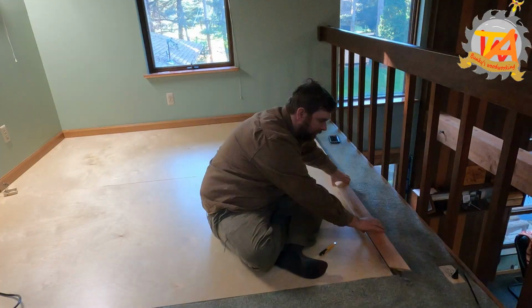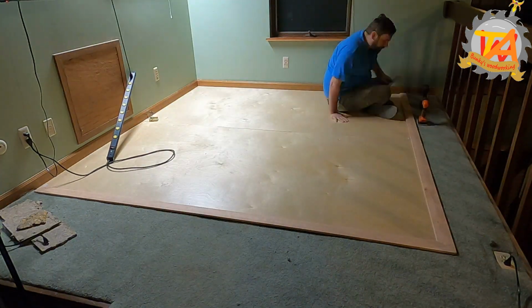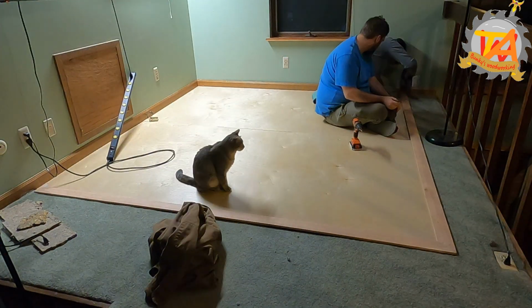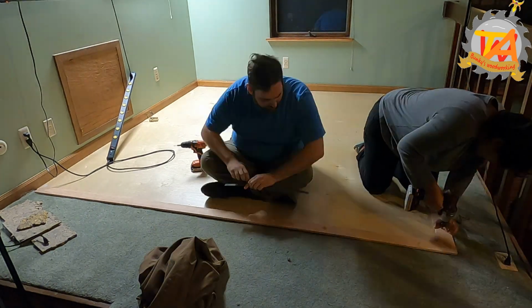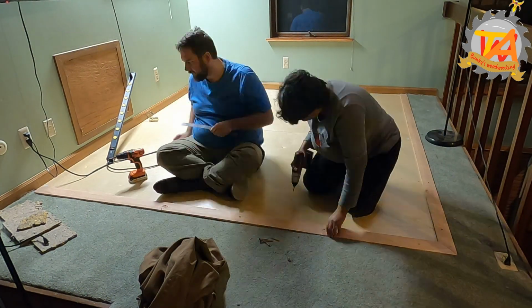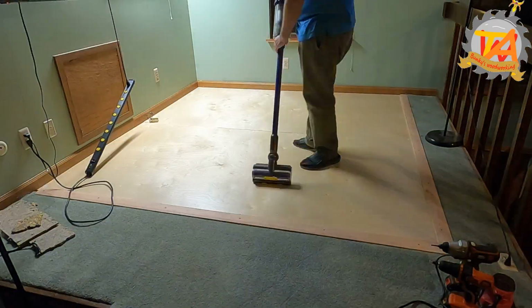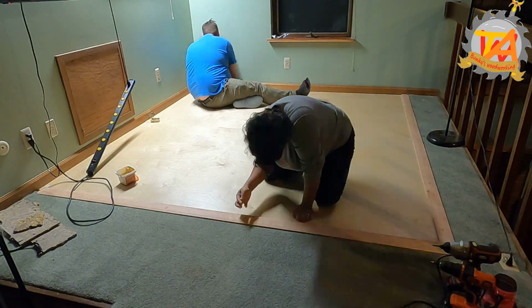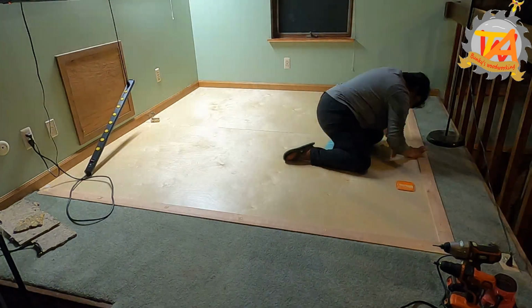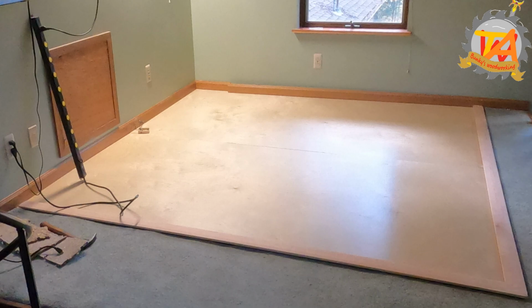Now we put the strips upstairs in order to do a dry fit. To fix the trim to the flooring, we made sort of an assembly line. Tim drilled the holes about 2 feet apart, and I screwed the trim in place. So we cleaned up the area, and then Aditi applied putty to all the screw holes, while I used construction adhesive in order to get the trim on the wall. After a quick sand down, everything looked absolutely gorgeous.